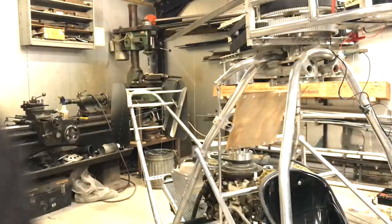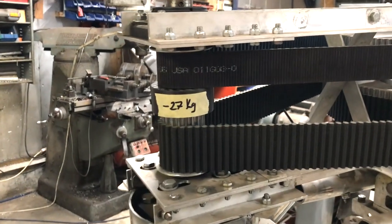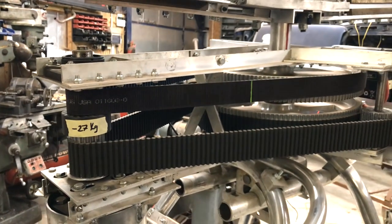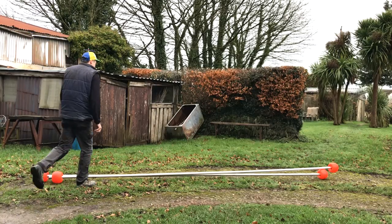The pièce de résistance is if I reduce the drive pulley by just 2 teeth, I would gain 5–10 horsepower, and that would equate to a minimum of 27 kilograms in extra lift. However, there are a few worries going this route which I won't go into now.